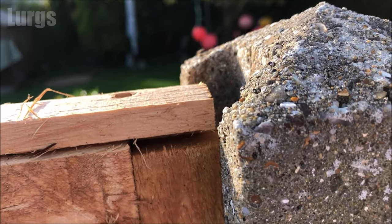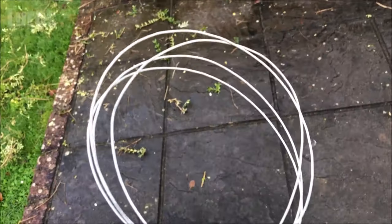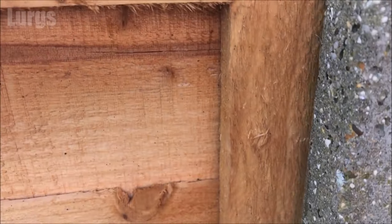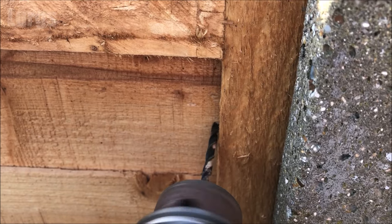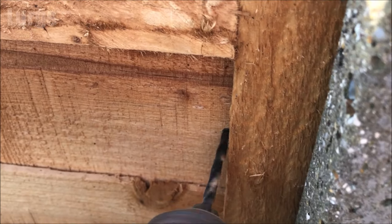Where we've got bits that are crumbling, it just gives a bit of extra strength and makes it last years longer. The first one I'm going to do is the end fence panel. I'm going to use some wire here — if you haven't got any wire you can just use an old coat hanger. Take a drill and a wooden drill bit and just drill a hole through the fence panel so that we can thread the wire through the hole.